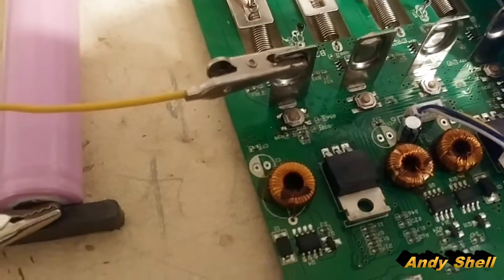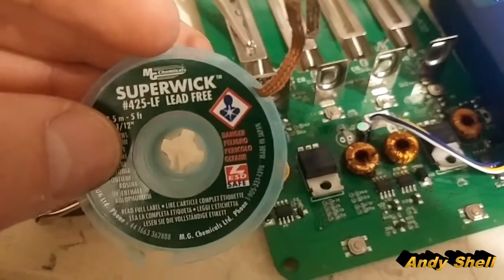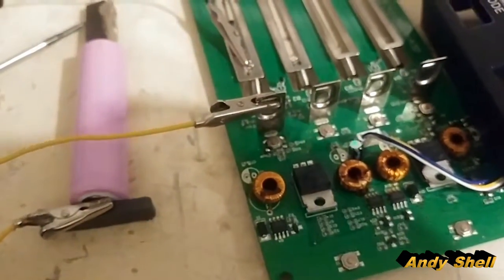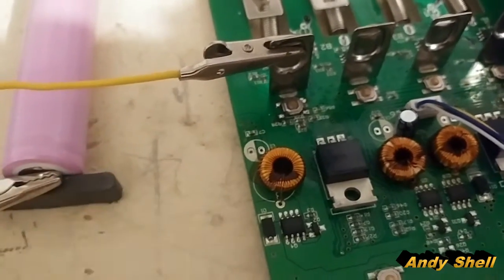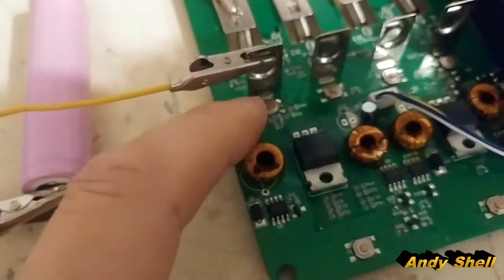I was right, thankfully. I very carefully unsoldered the old one. I had to use a really small flat-headed screwdriver. I absolutely needed this super wick braided material to soak up solder — a solder sucker won't do it. Those four pads are very well secured even without the solder. I had a lot of trouble and had no clue if the button would work, because I had to remove two of them — the first one failed and I lost another one. But it works now.